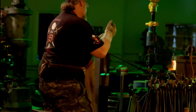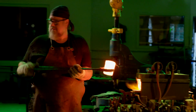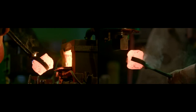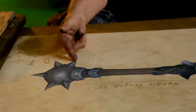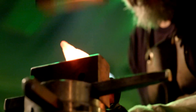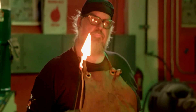To begin construction of the pommel, I'm going to take a three-inch diameter round bar, put it into the forge, and bring it up to a temperature of about 1,600 to 1,800 degrees and smash it until it looks like the pommel I want. The pommel for the Doom Hammer has five steel spikes coming off it — I'm going to forge those out of 1¼-inch chromoly 4130 steel, which is hardenable and extremely tough. I'll heat them up to the critical temperature of about 1,575 degrees and quench them in oil to harden them.